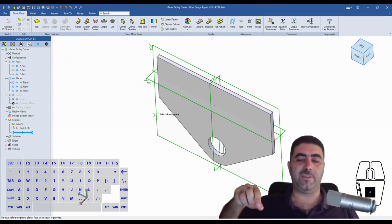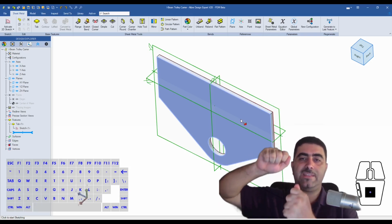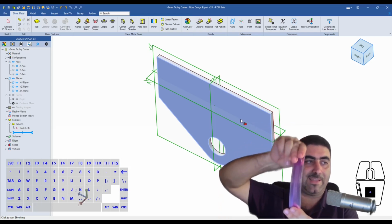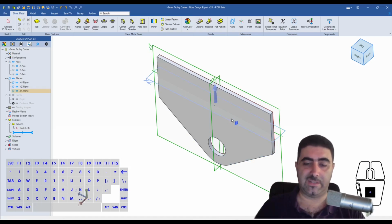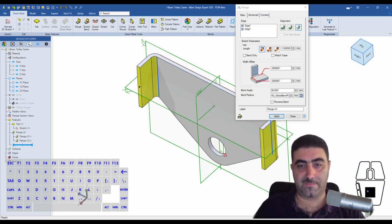So in our part here, we're going to have two holes here and here where the shafts are going to go. So when this takes the load, it's going to want to bend like this, right? And of course, the 4.5 millimeters of steel are not enough to take that. So what can I do to fix that? Well, I can add a couple of flanges here.